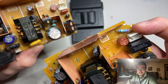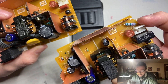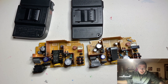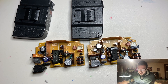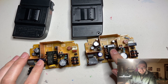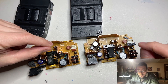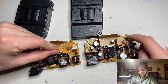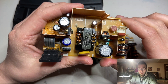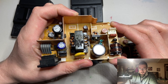I put this into a resistance calculator on the internet and this is a 27.5-ohm resistor, I think — someone who's good at electronics, please correct me. As far as I know, I'm the only one to actually post the difference between a North American and a Japanese N64 power supply on the internet, so I could be very wrong here — I'm just spitballing. But if the only difference between these power supplies is this resistor, that means that if you're plugging a Japanese power supply into the wall to power your Japanese N64 in the United States, you may be causing problems for yourself down the line.